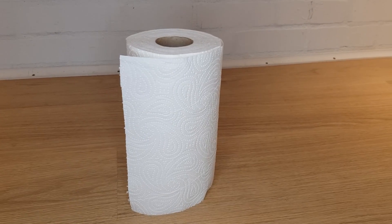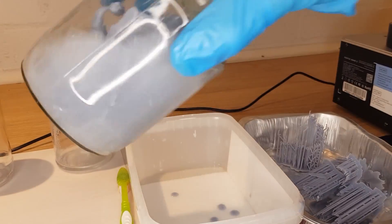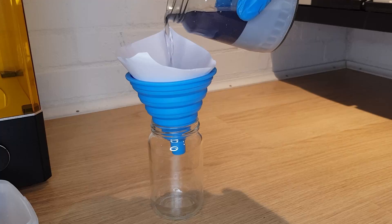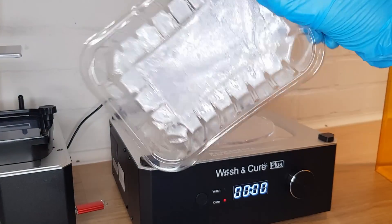You're also going to use quite a few more consumables with resin printing. If you're planning to buy a 3D printer, start saving those glass jars, takeaway containers and ice cream tubs — they can be really handy for dropping resin-coated parts into or for storing resin-contaminated alcohol. Rather than just disposing of the cleaning fluid once it's been contaminated with resin, you can actually let it settle, then partially cure the resin in the sun or the curing machine before pouring off the alcohol that's separated from the congealed resin. You can then fully cure this congealed resin so that it's solid and dispose of it safely, while your cleaning fluid keeps on working for you.